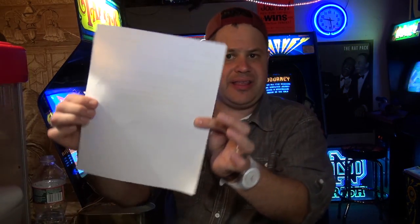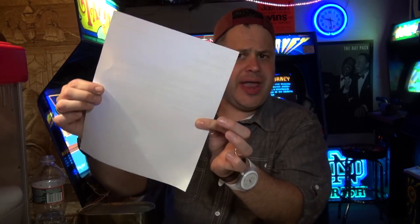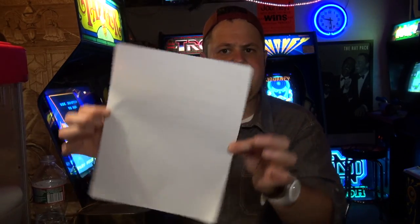Now, you said the picture on the monitor is crooked, okay? Are you saying that the picture on the monitor is kind of crooked like this, left, right? If that's the case, that's a yoke issue, okay? Because you could rotate the yoke, and when you rotate it, the picture will also rotate like that, left and right. The monitor controls don't have angle controls like this, okay?